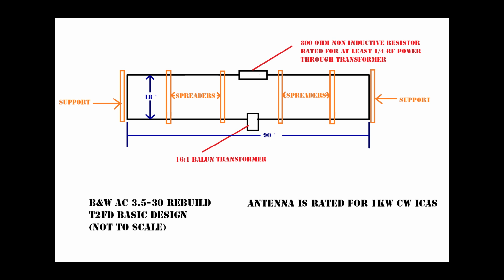Its popularity in commercial and military circles is as a set-it-and-forget-it HF antenna perfectly suited for ALE operation. And if one is in the market for a modern HF link establishment radio, this is typically a recommended antenna, as it requires no intervention whatsoever across its designed frequency range and is fairly forgiving in installation faux pas.